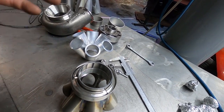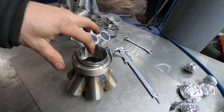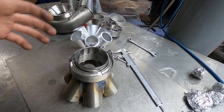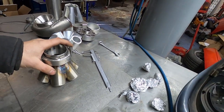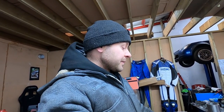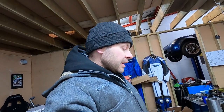That is actually where you get stainless exhaust manifolds cracking — it's because they haven't been purged, haven't been welded properly. Not because it's stainless. Stainless is actually very elastic. I've seen this before and said it before on previous videos.